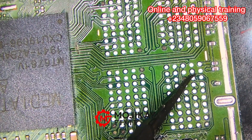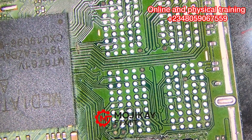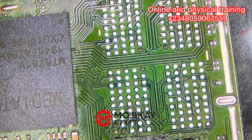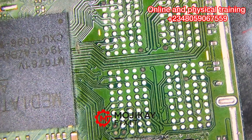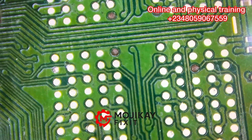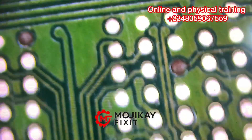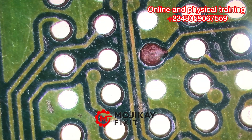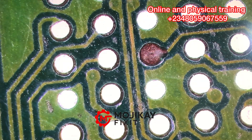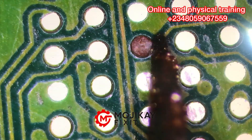Can you see this line? When you see a line coming like this and a pad is missing right there, that means you need to repair it. Other parts that are peeled for stability — if you check your schematic diagram, other parts that are peeled, especially for this particular device X650, are not connected.